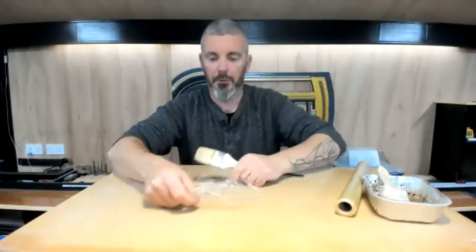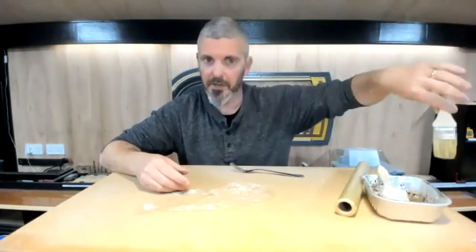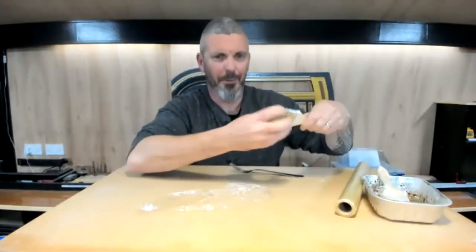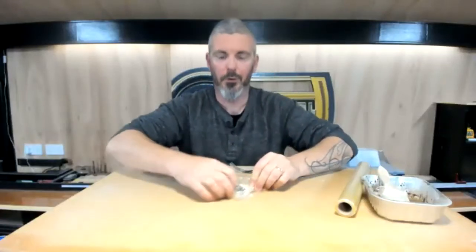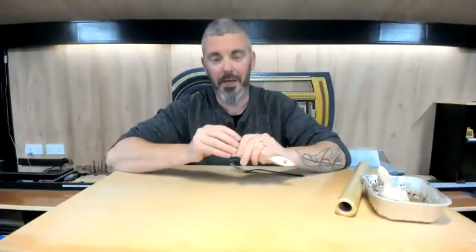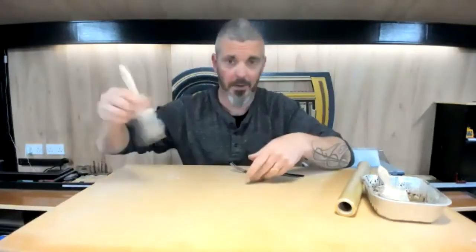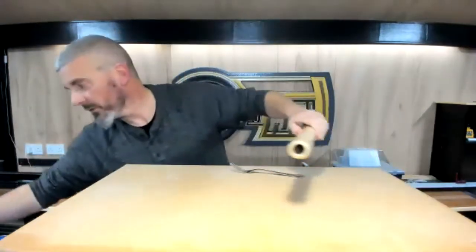Say I have a brush here, and if I'm putting it on, what I will always do is dip my brush into whatever paint I was using. Load up that brush, not slopping or falling, but a nice bit of paint on there. And then when you wrap it, make sure you push the air out before you tie it up. Inside here, there's no air, and air is what cures paint. So it's only wet paint that it's surrounded by. That'll be perfectly grand. You'd be there for a week, no problem. You come along, take the tape off, and off you go again, like it was a brand new fresh brush. So that's a really handy way of saving effort and time. Great tip.